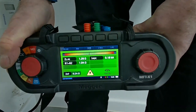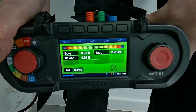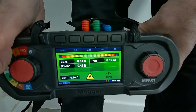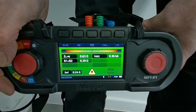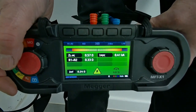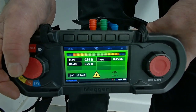As I said earlier, the value I originally measured was 0.24 to 0.25 — it was fluctuating between the two and it was a dead test. You can see from the bar at the top there's a confidence meter. It's struggling with earth noise in this building for some reason, but let's give it a little bit of time because it will sort itself out. I'm pretty confident it's going to give us an accurate reading. It can be annoying of course if you're waiting, but it's far better to get an accurate reading than to just write down any old rubbish.